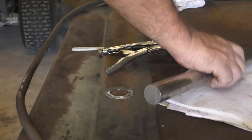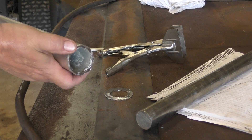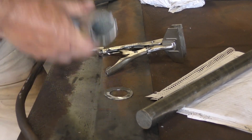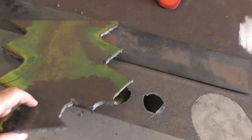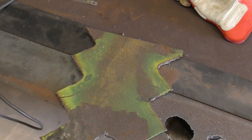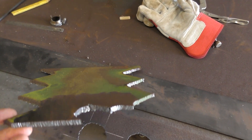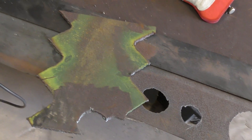I started to give it a gentle knock and you can see the tube has already started to collapse a little bit, so what I'll do is weld a bit of plate on top to strengthen it and share the load more evenly with the hammer. I've got a piece of 6mm plate — nice and heavy duty — left over from the keel sides when I put the sides on the keel. I'll cut a little circle or square from it and weld it to the top of the tube to use as a striking face.